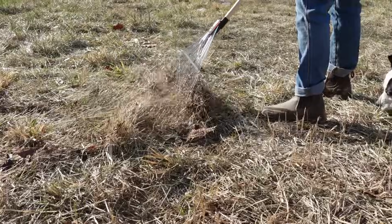For our fiber, we use some chopped straw as well as a lot of long dried grass from mowing the land earlier in the summer. There are a lot of options for fiber, but a good rule of thumb for testing that out is to grab a bundle in your hand, and if you can't easily break it, then it's probably strong enough to use for plaster.